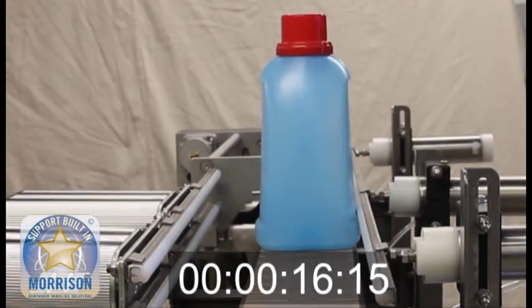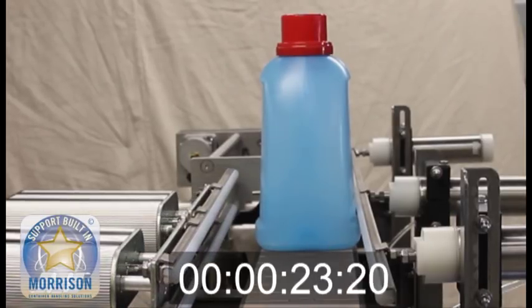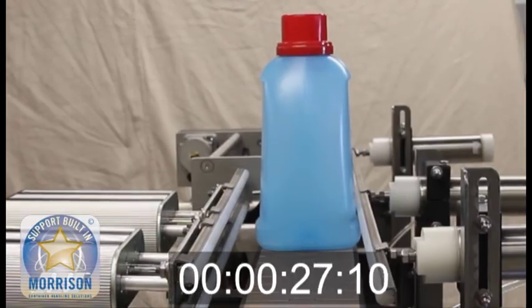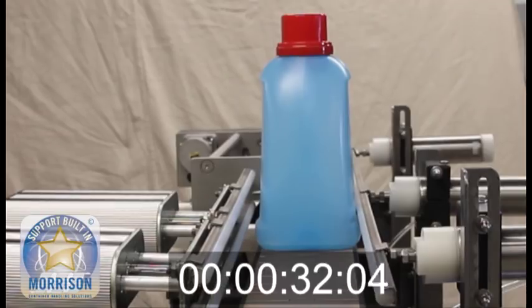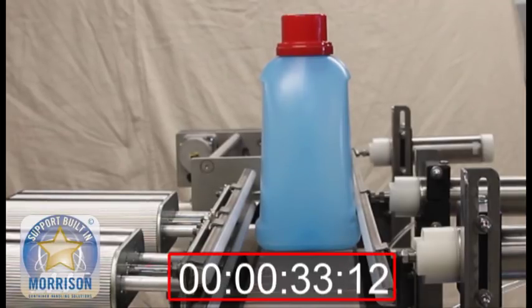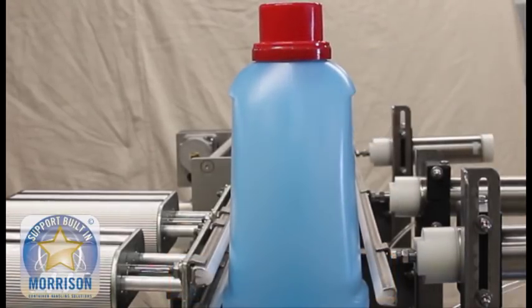All of the rails will release this air to recalibrate the cylinders. Once all the air has been released, air pressure will engage to the level required for that specific recipe. It is incredibly precise as it goes back to the required position, with the case positions having a consistency of plus or minus five millimeters, and the container cylinders a preciseness of plus or minus one millimeter.